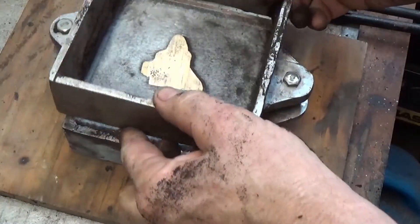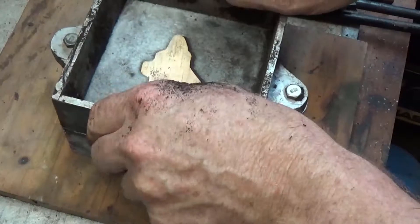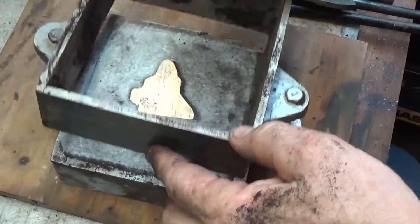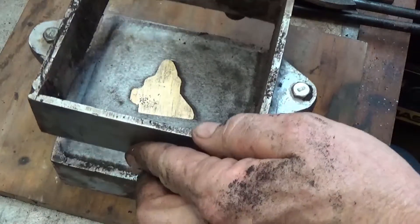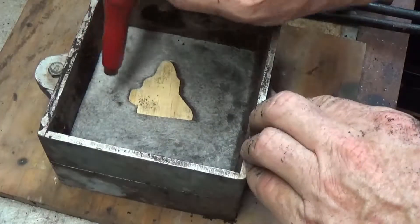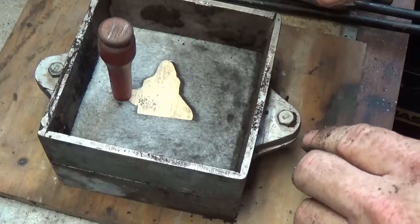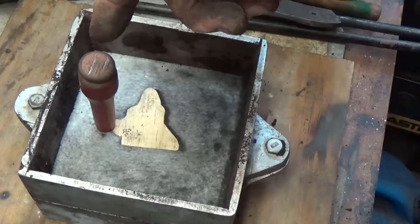We'll go ahead and put the cope on top of it. I have these color-coded. Now whenever I pull the top off, this is going to stay. I also have these at an angle — I cast these out of aluminum. There's a bit of a keystone taper, so when you pull up on this, the force of the sand holding on itself keeps it in place. The next thing I want to do is add a sprue, which is where the molten metal is going to pour through. I turned this down from a piece of pine on the wood lathe and painted it so nothing sticks to it. This is where I'm going to pour my molten metal once everything is done.